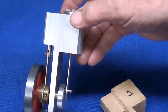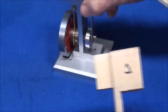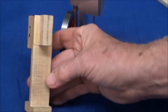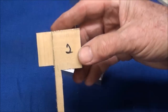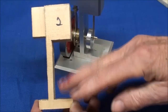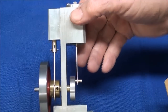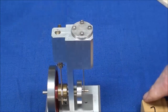I failed to show you this in the previous video, but when I started making this particular engine I simply took a piece of basswood — or you can take a two-by-four or whatever — and using the bandsaw I rough cut this to the exact size, just to see how things are going to work. This was number two, so I think I did a total of three of these until I got the dimensions that I wanted. That's how I developed this one, and it was developed around the one-inch by two-inch aluminum stock that I had quite a large supply of.